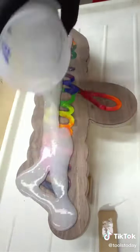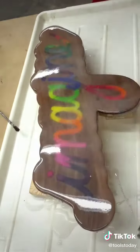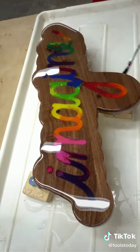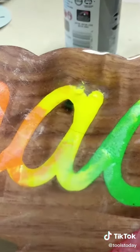I thought I got it fixed and got everything in place, and used some TotalBoat tabletop epoxy over the top. As you can see here, it's full of bubbles, which means that I didn't have the right temperature. Using a torch and a heat gun I was able to get most of the bubbles out, but the crayons actually ended up creating their own bubbles from all of the bubbles that were underneath.